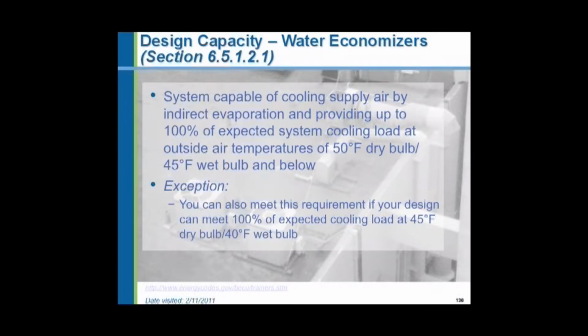That can be a cooling tower, or it can be an evaporative condenser. Now, if it's cool enough outside, they're saying, why not use the cold air directly to make chilled water rather than having to run this machine? So they're saying, if the air temperature outside is cool enough, use it to make cold water. Well, remember the 55-degree air temperature. Typically there are 10-degree differences between fluids in a heat transfer situation.